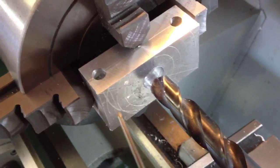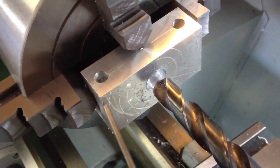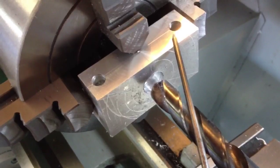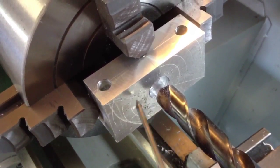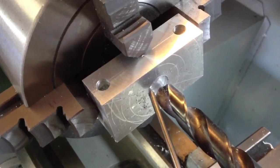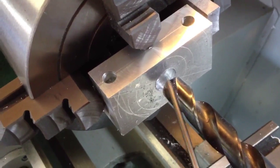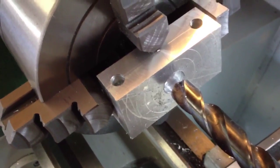I've squared the block up in all four corners and got it perfectly square. I've marked my holes for where to bolt it down into the saddle — you can see some scribed lines here. This is the way I've set it up in the four jaw chuck. I've centre drilled that, then I pilot holed it, and then I'm running, roughing through a 13mm drill bit now. And here we go.